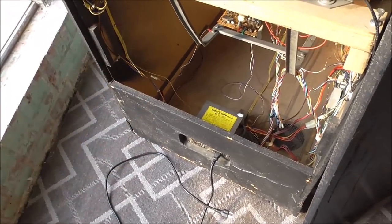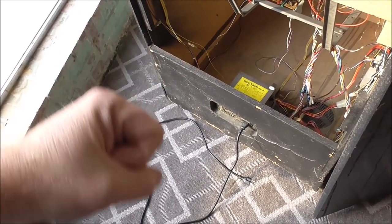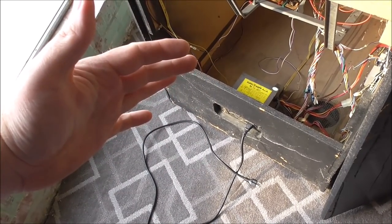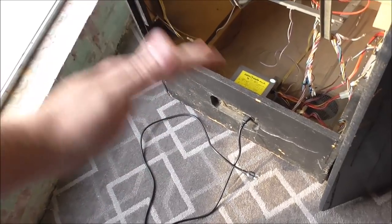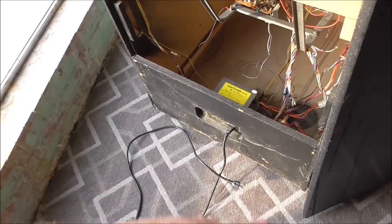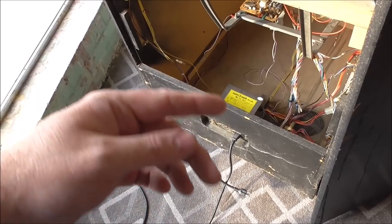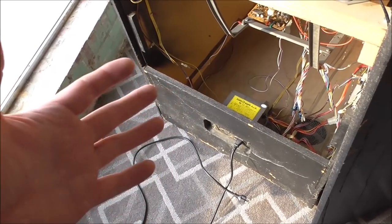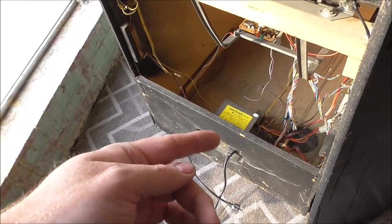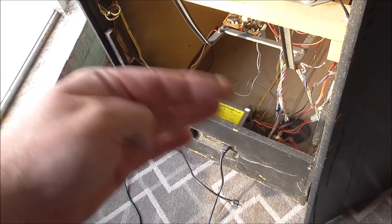All right, so that ticking is the high voltage of the monitor coming on, and then going, oh, wait a minute, I can't do that, and shutting back down, and then trying it again. You're hearing it turn on and off, on and off. Tick, tick, tick, tick. Different monitors will do it at a different speed. Basically, it's trying to start and then shutting down, trying to start, shutting down.